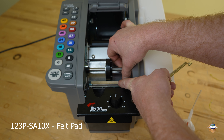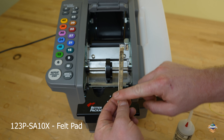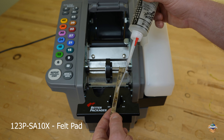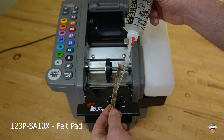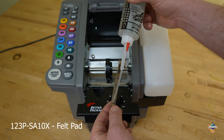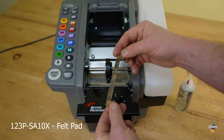Since this is a new machine, I don't want to add too much oil to this felt pad. So I've got an extra felt pad here — this one is dry. We use a Zoom Spout oil and you just want to coat this felt pad in oil. You'll notice what it looked like when it was dry, and now that we're adding oil to it, it looks saturated. It's easier to oil these things outside the machine than inside. You'll see that felt pad is now soaked in oil.